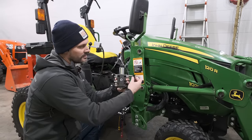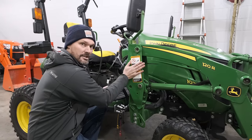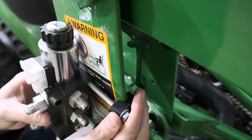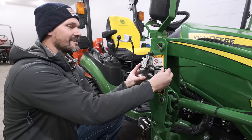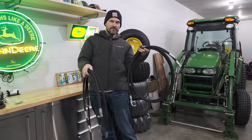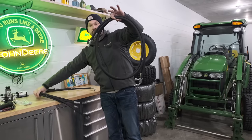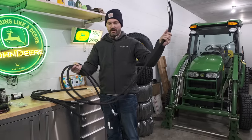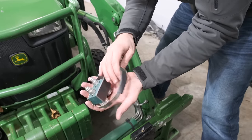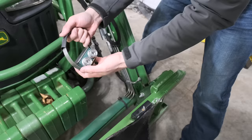You're going to use these two brackets here - you can see this is a threaded rod. You can see the little groove in each one of these black slots. You want to mount this on the inside rail. You put it on there, clamp one side and then clamp the other side, and use your wrenches to tighten it down so it squeezes - that's how it holds in place. You'll have short hose sections going from the tractor side to the block and back, and then long sections going from the diverter portion of the block all the way up front to the business end down at the front of the loader arms. This fitting goes right onto the end of those hoses - it comes with a clamp that you put around the tube on your loader up front and adjust accordingly.